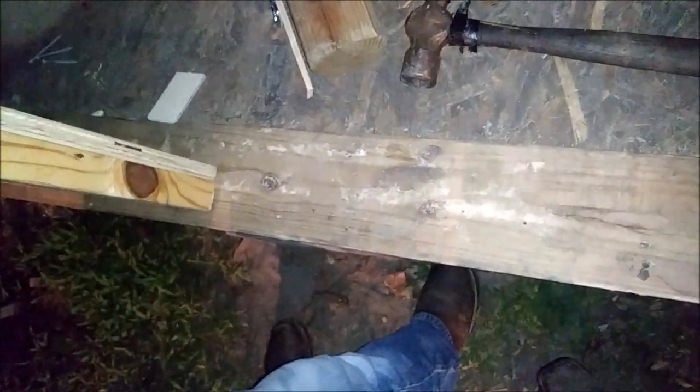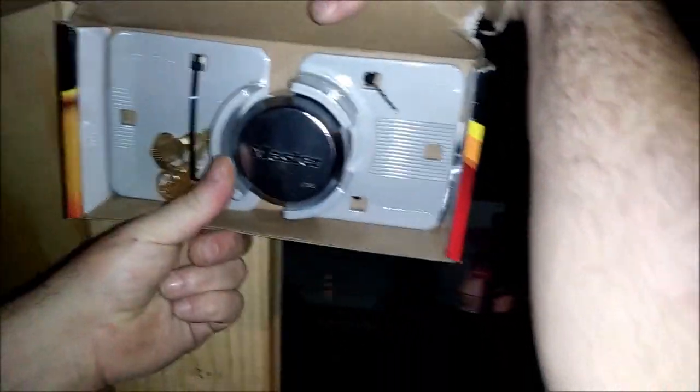So this is one of our do-it-yourselfer projects. We got non-treated wood here, but it's going to be painted with oil-based paint. It's got Liquid Nails in the middle, keeping it together. Plus, it's screwed on the backside. It's braced. We're gonna put our stoppers here. I'm gonna run a rail down here to stop our doors and make them close properly. We're gonna install a giant hasp. This is probably one of the most expensive locks I've ever bought. It's like $29. It's gonna have two plates of steel behind it right here. Nobody's coming in here. Not without me hearing them.